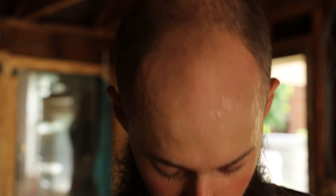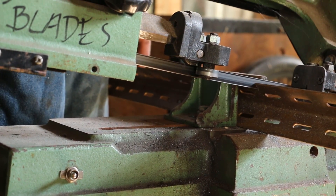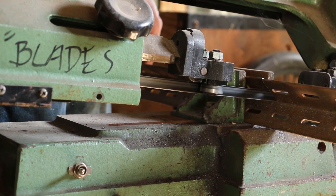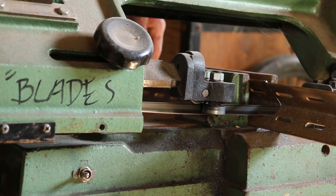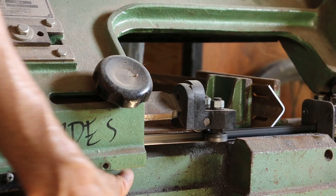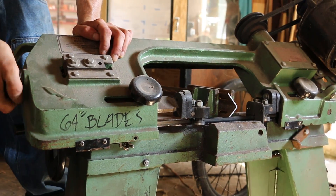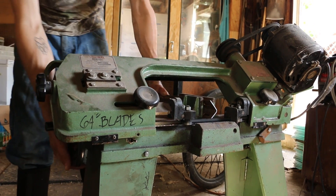I'm holding the steel and watching the sweat just drip off my nose and eyebrows — I don't like the humidity. A bandsaw like this for cutting thin steel is a little overkill, but it makes life easy. This thing is going to be super useful when we're cutting all the drifts and the keel bolt fasteners, because the keel bolts are one and a quarter inch diameter solid silicon bronze rods. Imagine cutting through that with a hacksaw. With this, you just put it in and the weight of the head will slowly cut through it. Normally I don't hold on to the head, but with this light metal the blade is fairly aggressive and the weight is a little too much — it'll take too big of a cut — so I was just gently holding up on it as it went down. But normally you just set it and walk away, and a few minutes later you'll hear the metal fall on the ground and know it's finished. You can come by and shut it off, which will be great when we're cutting up all those bronze rods.